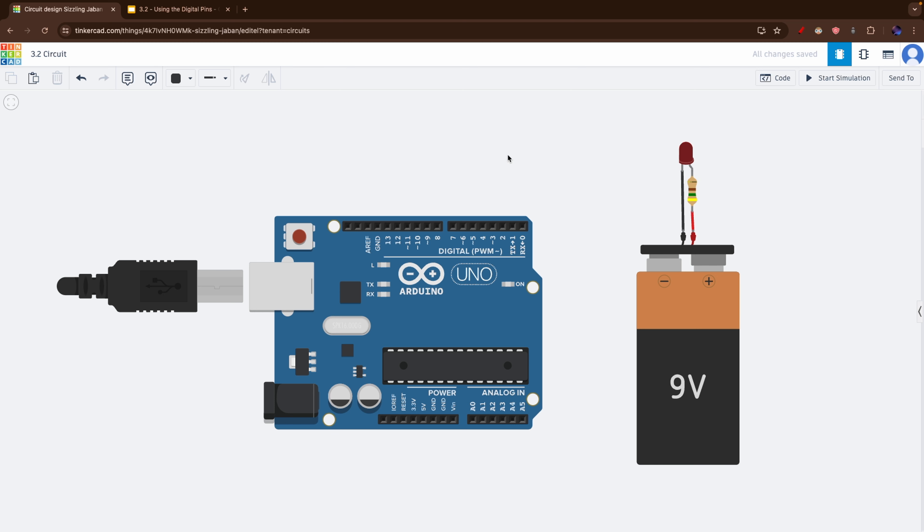I'm going to cut and paste my LED here. The cathode goes on the ground side, and then the resistor — which is just a fancy wire — goes into the anode, straight into digital pin 7 right here. That's literally all we really need to do in order to transplant our circuit from the battery to the Arduino.